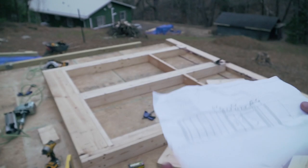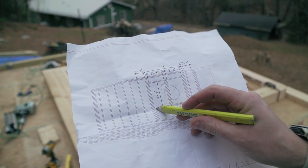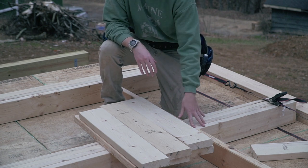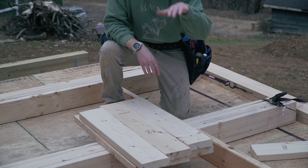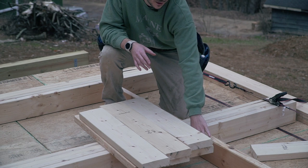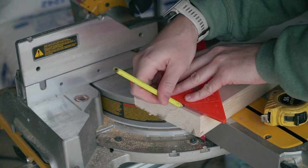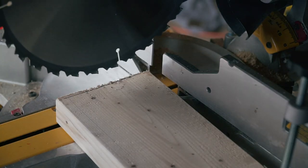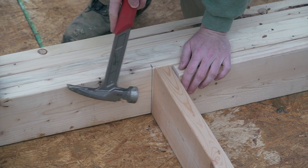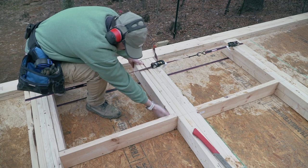We're slowly making progress, but we're getting there. The only thing I have left to do is cut the pieces that will support the bottom sill of the window — six pieces total. One thing to keep in mind: when you install windows, the bottom sill needs to have a little slope to it, because when you do all the flashing, if any moisture or water gets behind the window it will naturally run off the sill and drain out. We're gonna slope the sill by a quarter of an inch — just a little bit, a quarter inch is all it should be. If you did your cut correctly, it should just fit like a glove.